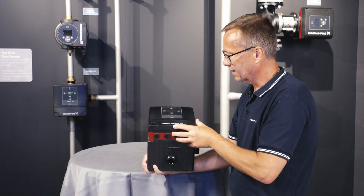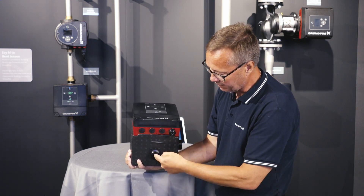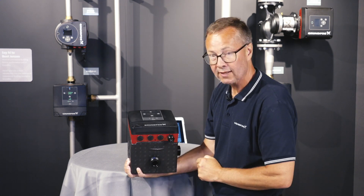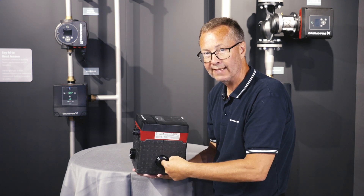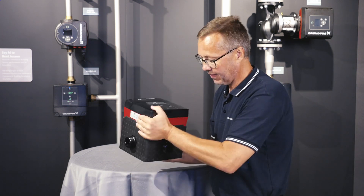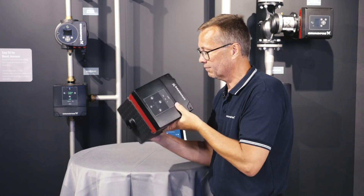You can see we have the A port. The A port is always where you have the flow sensor — you can see the insert with the flow sensor here. The B port is over here and in this situation we have a check valve inside the non-return valve. Then we have the A-B port up here where we have the mixed water temperature.